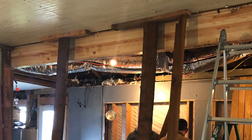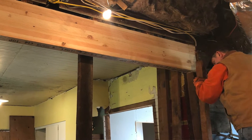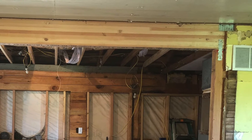The other trick when you put in a beam is you need to prop up the ceiling when you're taking the wall out so the house doesn't collapse while you're working on it. I had it all prepped — it was a Saturday morning, I had donuts, I had guys coming to help put up the beam, and it actually went great. In a couple minutes we lifted it up, got it into place, got it nailed in and up tight against the joists. For the next couple of days I did all the braces and I thought it looked great. I was going to call the inspector to approve it and tell me what a great job I did for a guy who didn't really know what he was doing.